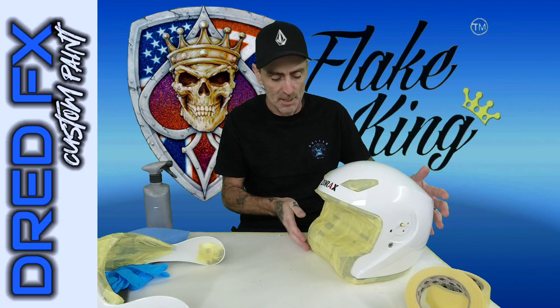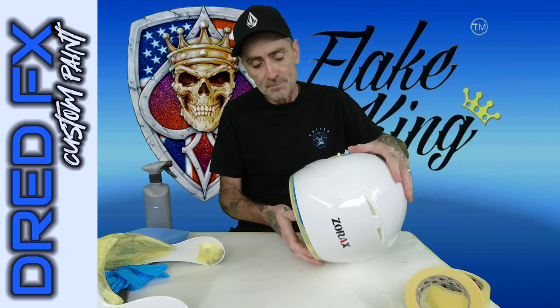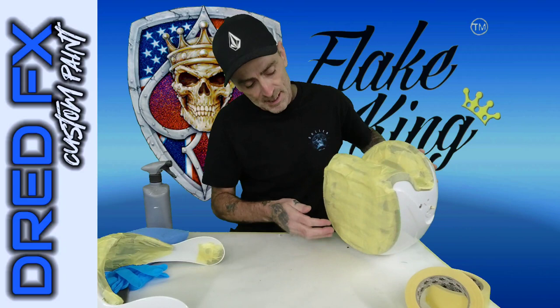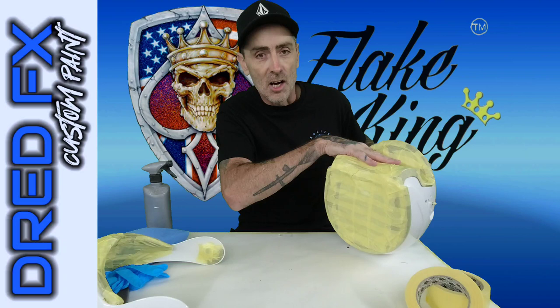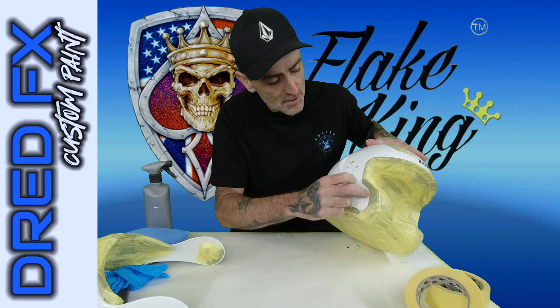The first piece that I did was this bottom edge, and I put some 3mm fine line around that and then gone in with the masking tape on top of the fine line and basically just gone round the lid and masked off all that internal piece so you don't get any overspray on the bottom. Went over the edge here, and this is a raised lip on this, so I'll put the masking tape over and then very carefully scalpeled the edge of the masking.